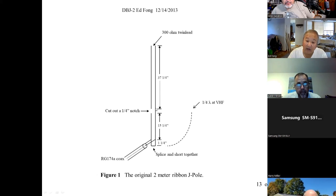It matches the high impedance of the antenna here. It's opposed to the middle. The middle is a low impedance, but it's not practical. There's no simple way of feeding this thing with some big arm. And it's a mess. It doesn't last long. It doesn't hold up to wind. This does hold up to wind much, much better.